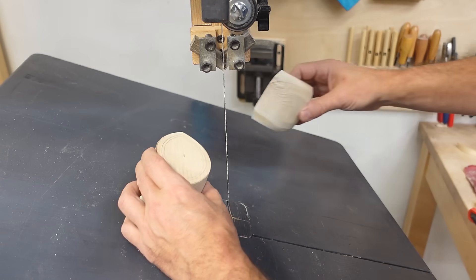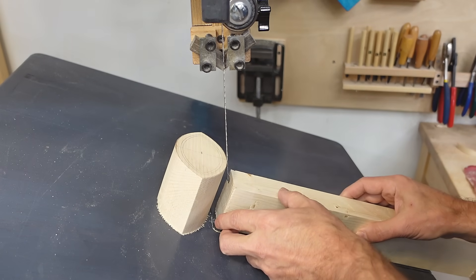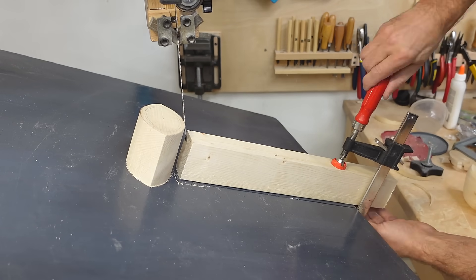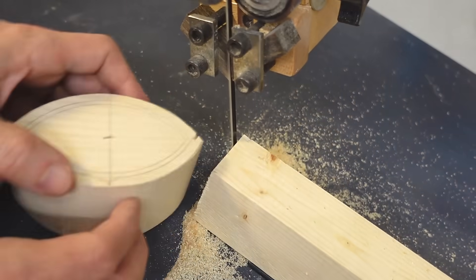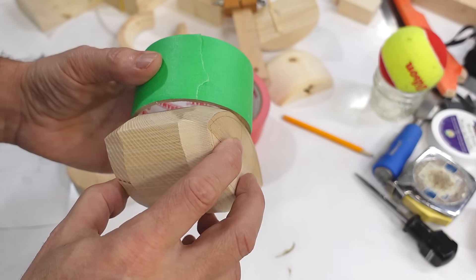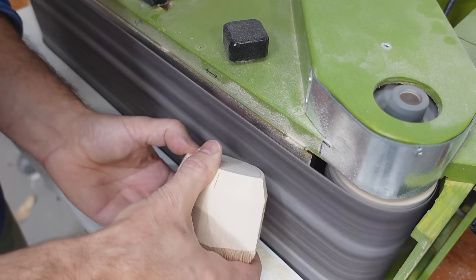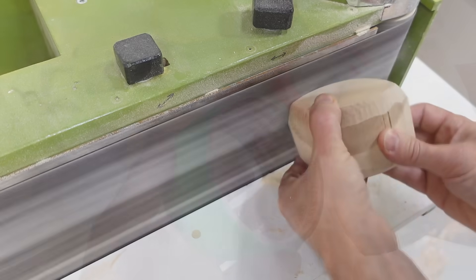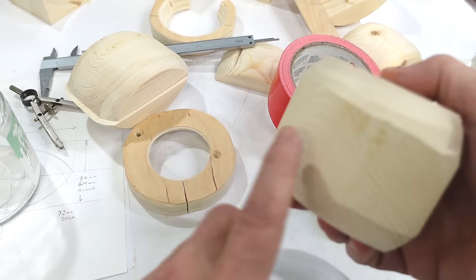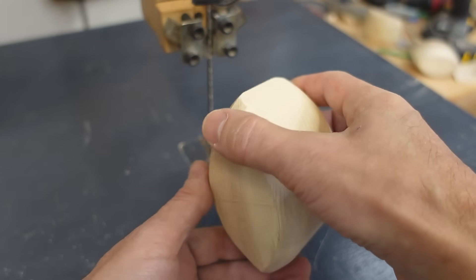You do need a very sharp quarter-inch blade for this kind of cut in hardwood, otherwise it'll go all squirrely on you. Tilting the table to 20 degrees — working with a big blank is a lot safer than a little one, but it's still a bit hairy, so I've got a safety contraption: a piece of wood that goes on here so that if it catches it can't go very far. This is still a freehand cut but much safer. Checking with a circle, it hits just on the corner, so I bevel it a bit more to make that edge like part of a sphere — and it fits really nicely. A smaller or slightly larger circle will work too, and having sanded off the bandsaw marks I can now cut it down the middle.